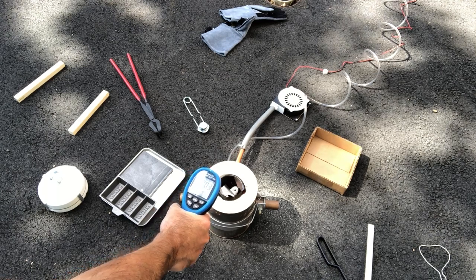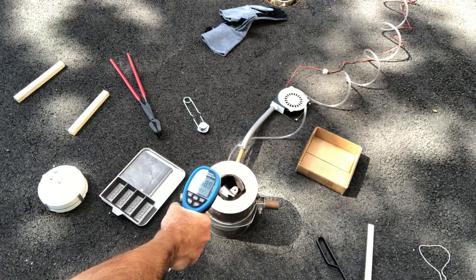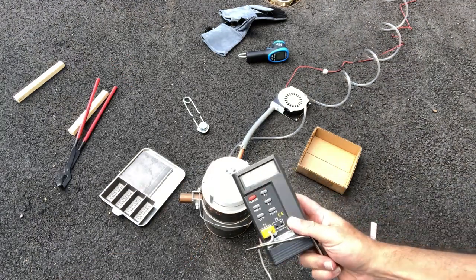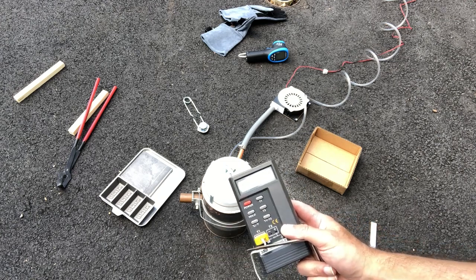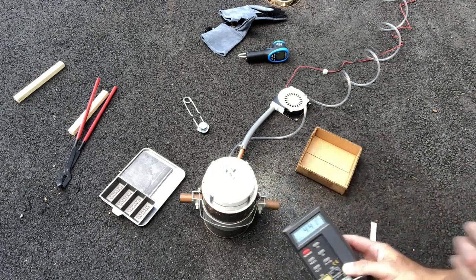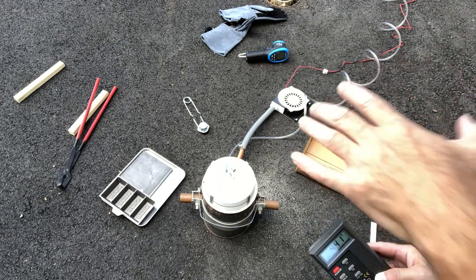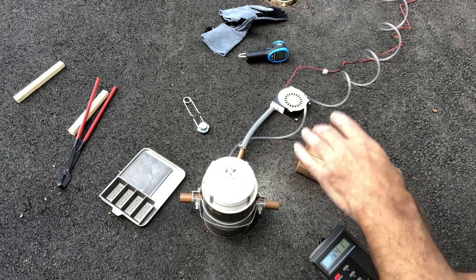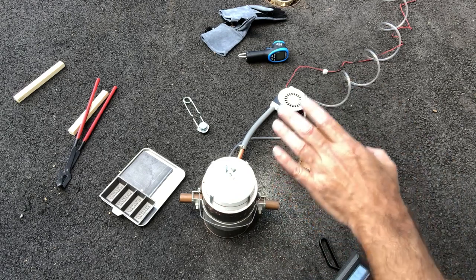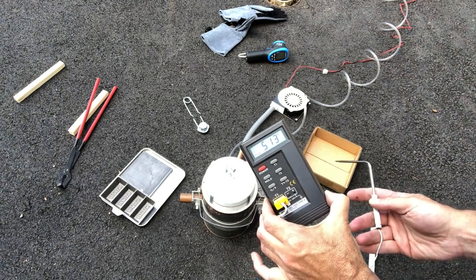You can see that we are getting to the melting point of aluminum — 660 degrees Celsius. I showed the infrared pyrometer but I also have a thermocouple meter. The good thing about using a thermocouple is you don't have to worry about emissivity. With a thermal pyrometer, the molten metal and the dross floating on top in the crucible have different emissivities, so typical IR sensors aren't that reliable for molten metals. That's why I'm going to use this thermocouple.